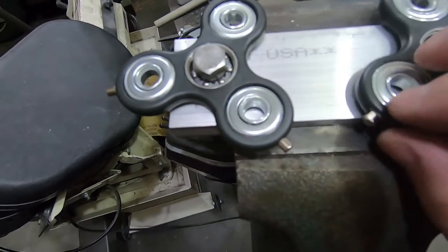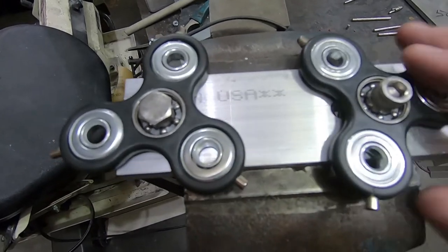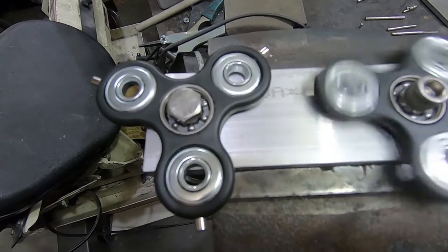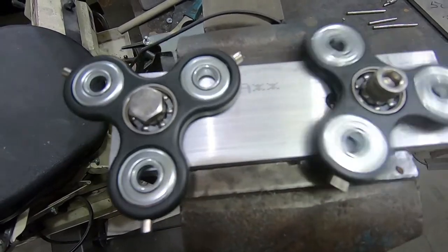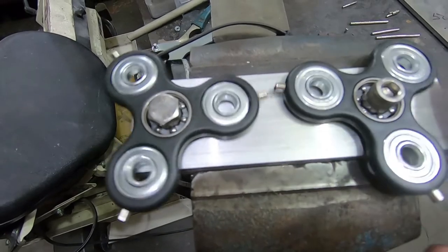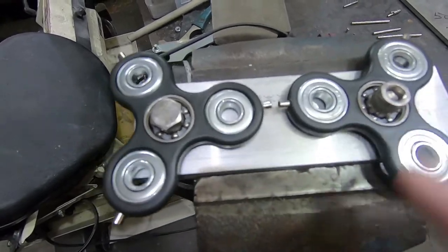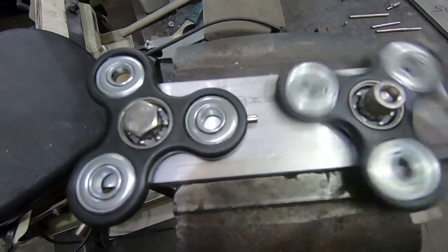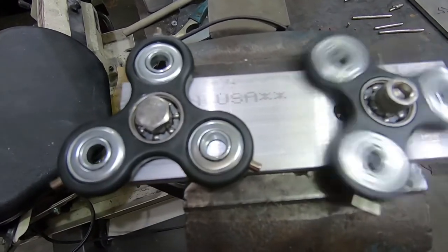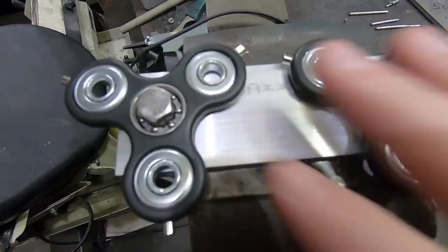Here we are with the medium-sized 4x8mm magnets, and I think this is going to work. I was trying to get good coupling between the two, but not so violent that it wants to pull the magnets out of each other's side like I was getting with the larger quarter-inch magnets. I think this is worthwhile to continue. There's still some open questions - should I set the polarity so they're all positive pointing out for a repulsive effect, or have some attractive and some negative? Obviously since there are three arms I can't completely balance it, and maybe that's for the best.